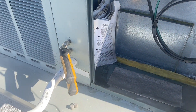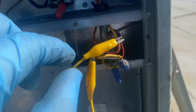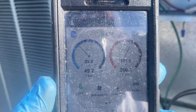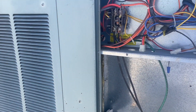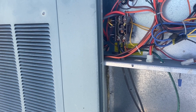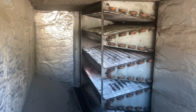We're going to go ahead and jump this guy on — we've got our gauges hooked up, ready to roll. It's our R-22 old boy. Let's see what our pressures are doing — suction is slowly dropping. It's definitely below freezing, so first things first we're going to check the filter, make sure the blower is actually running, and we'll go from there.